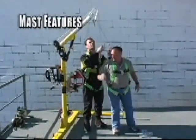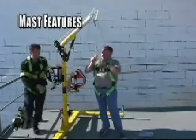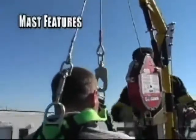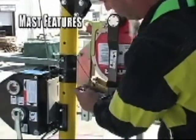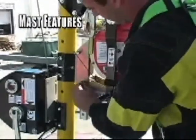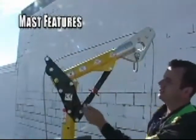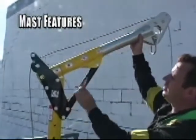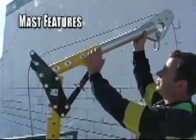The one-piece adjustable mast is designed to accommodate several applications where multiple offset masts are required. It can be combined with front-mounted and/or back-mounted winches and self-retracting lifelines. The mast features a 5,000 pound, 22 kN bracket for fall arrest anchorage.